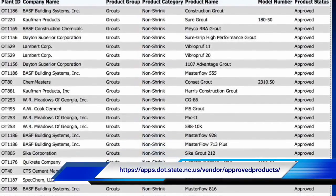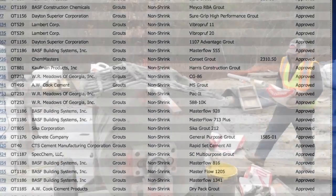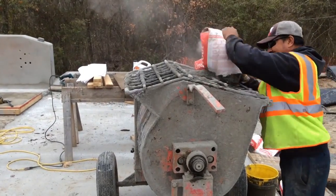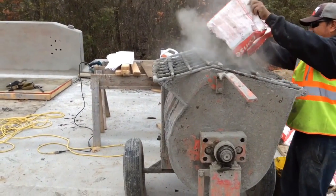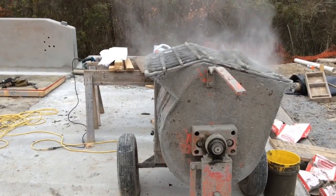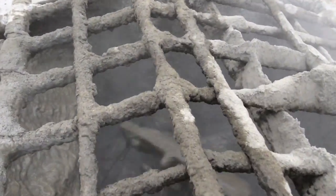After receiving the grout on site, check to make sure that it is on the M&T list as an approved grout for structures. In most applications, prepackaged grout will be used. It's important to follow the manufacturer's recommendation for mixing. Instructions should be printed on the grout bag packaging. Only when allowed by the manufacturer and the engineer, aggregate may be added to the mix.